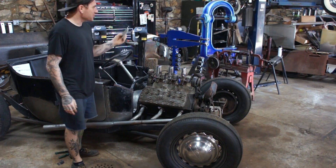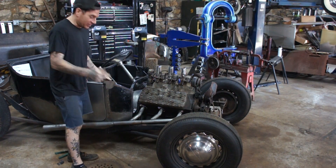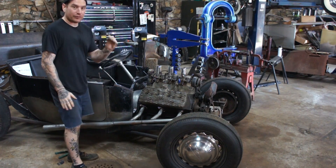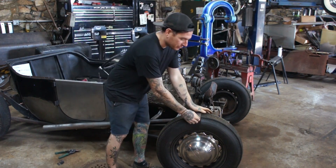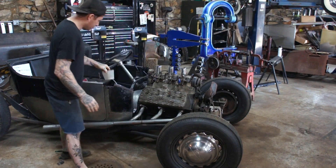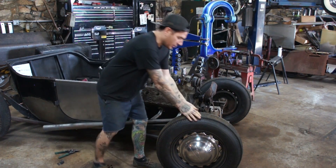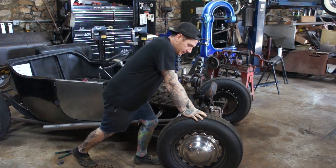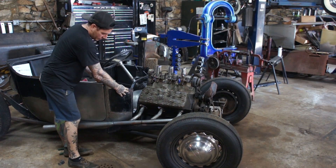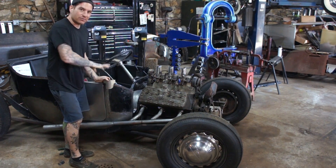Even with all the fancy tools that I have in the shop — English wheel, everything else — sometimes I just use the simplest of things that you probably have laying around as well. So this needs a little bit of shape to it, more form. It doesn't actually need to be stretched or anything. It just kind of curves around here and I have a flat piece of metal. So really what you could do is just put it on a soft surface, whether it's a piece of wood or a tire, and we can give it a little bit of a curve. Just keep working the piece to put the curve in it that you need — you don't need a fancy expensive tool to make a patch like this. This is a cheap, quick little way. Don't be afraid to use something that's laying around that has the right radius you need to just bend it over.